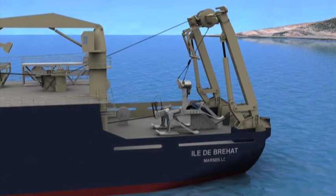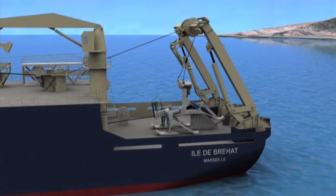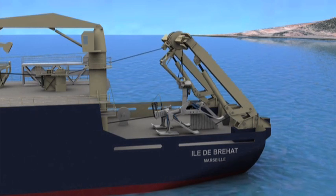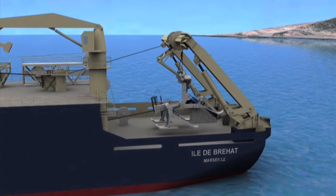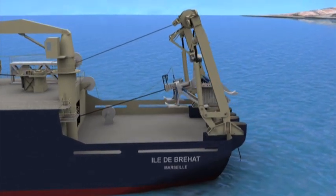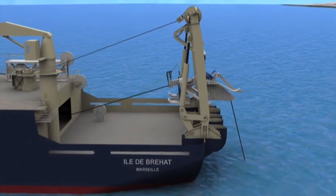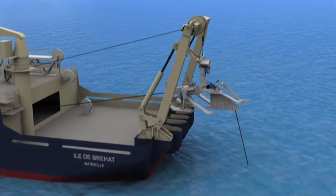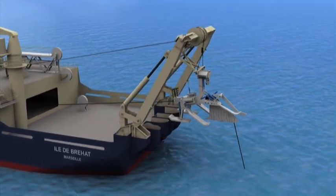The armoured fibre-optical cable is loaded into the 30-ton sea plough, which is over-boarded, simultaneously controlling the cable, tow wire and umbilical tensions. The umbilical transfers control commands and burial information to and from the plough control on the vessel to the plough on the seabed.